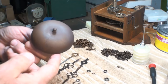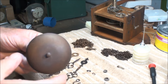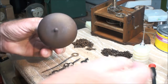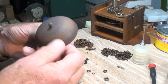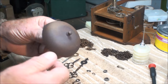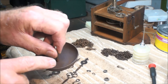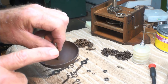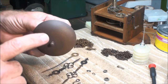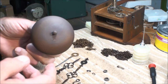The bell is just a steel bell. It doesn't shine up or anything else. I used a brown scrubby on it, and most of it is help take some of the rust off. What I plan on doing is painting this, but I'm only going to paint the outside, not the inside, so that when it rings, it'll have a solider ring, even though the little bit of paint I put on here is going to give it some deadness to it.